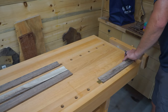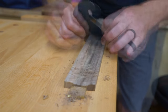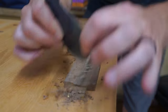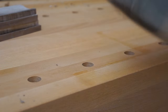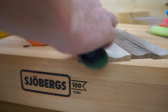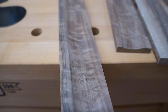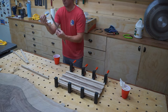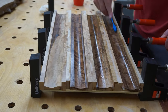The center of the frame will be made from the heartwood with a little splash of sapwood. I'm going to take this and cove it on the table saw and then border it with sapwood strips. The piece will be finished with oil and then a furniture wax that will actually darken all the sapwood, so we won't have this big contrast between the sapwood and the heartwood. The goal is simply to do everything possible to show off the medullary rays in this beautiful wood.